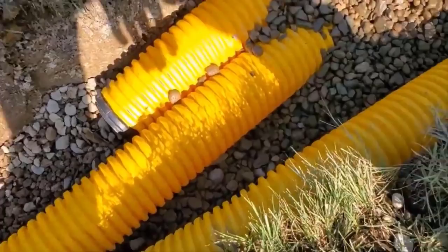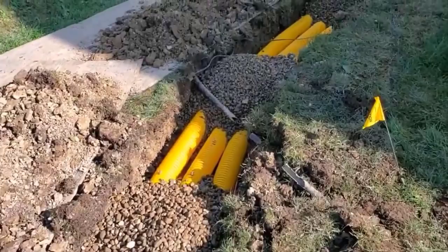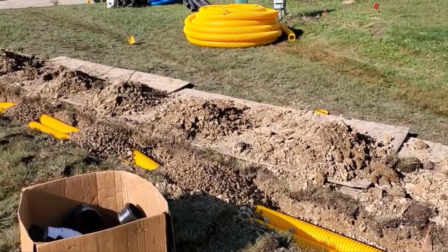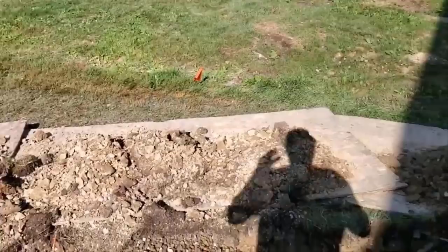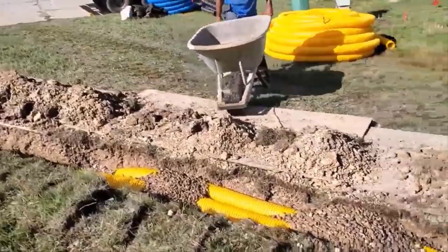So this is a small leach field. It's going to be a reservoir, and during light rains, it will take care of the water. This system here is pretty amazing as far as being able to disperse the collected bulk water, protect the home, and then across the front of the yard, let the leach field do its job. So just wanted you guys to see this, because seriously, this crew gets this stuff put together and buried so fast, I miss it. So I just wanted you to see the nuts and bolts of it.